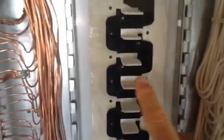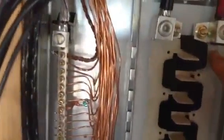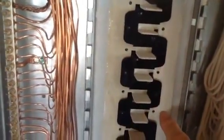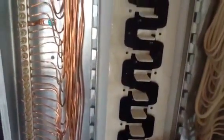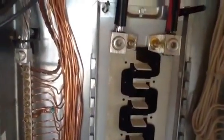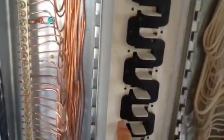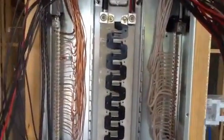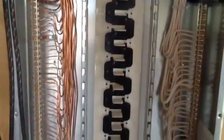I want you to look at this bus bar right here very carefully. Look at the right-hand side and see how it goes down and is tied in. When you're actually counting your breakers, on the right-hand side are your even numbers and on the left-hand side are your odd numbers. That's how you get your 240 volts, because one side of the bus is 120. On a panel schedule, the left-hand side will be one, three, five, and your even numbers will be two, four, six on the right-hand side, all the way down to 40 or whatever your panel is.